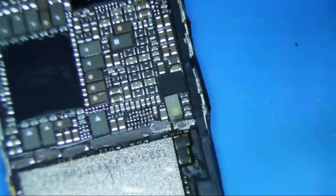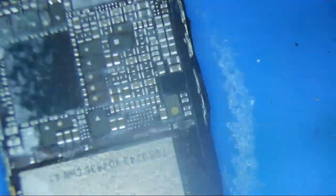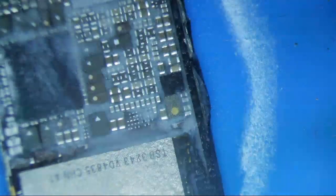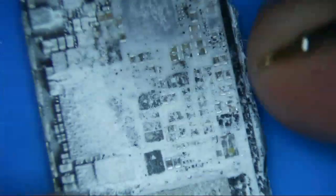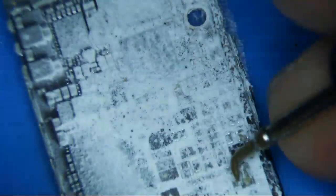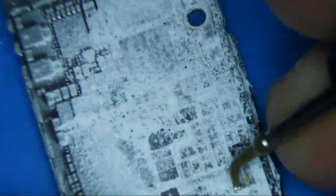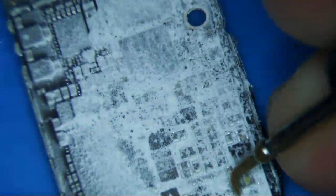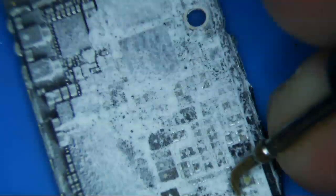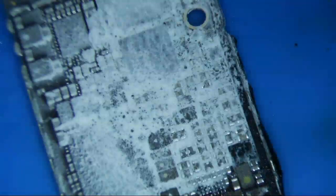I think I'll just freeze spray it, find our points, and then we'll start poking. I just want to get it in view here, and then you can just pop it — make sure you're getting two amps blown through it. Then just look for a cap that's overheating faster than the others. I don't see anything down there.